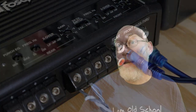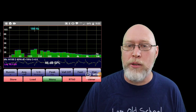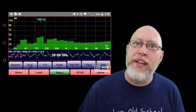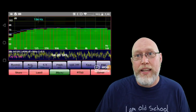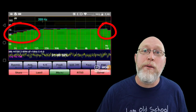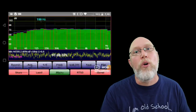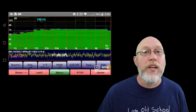I've got a screen capture app so I'm picking up the output from the RTA, and the first thing I notice is I've got a problem — there's some noise in my system somewhere. I'm not sure where it's coming from; I've got a lot of different things in my signal chain. Next I'm going to run some pink noise through the RTA, and I notice the pink noise at the very high and low ends of the frequency spectrum is not picking up. It's not flat like I expected. I'm not sure if that's a problem with the phone's microphone or the Bluetooth connection, but right off the bat we see some downside to this cheap RTA. Hang out until the end and we'll do a pro/con list.